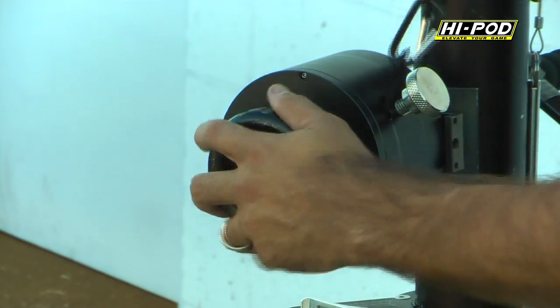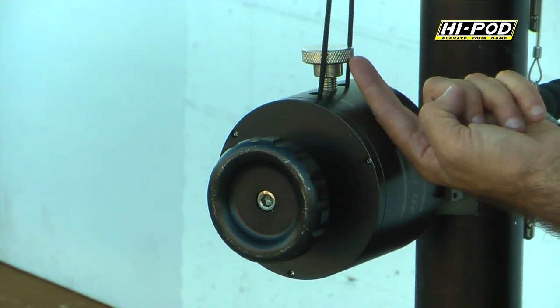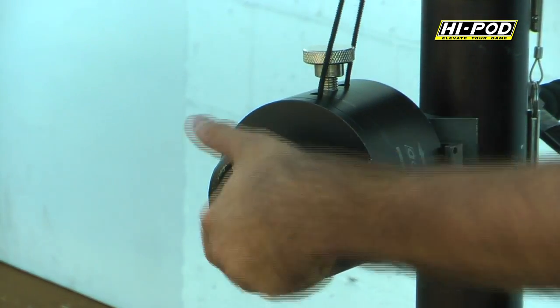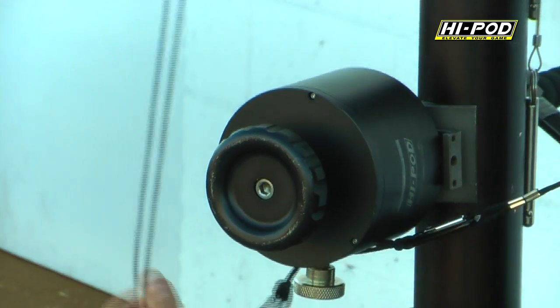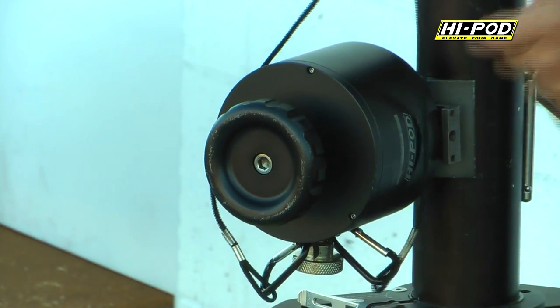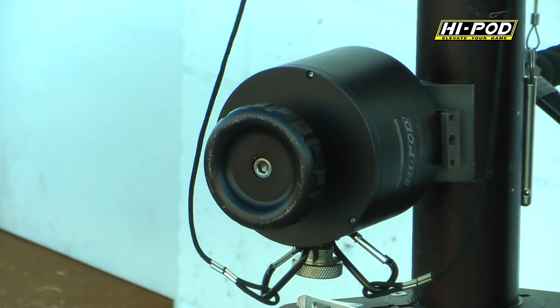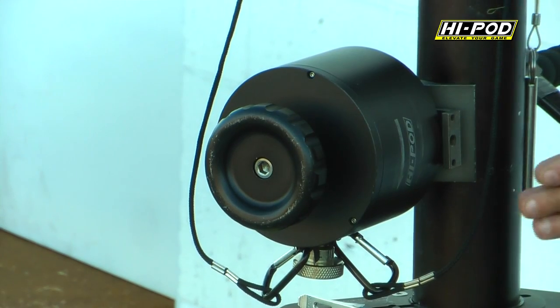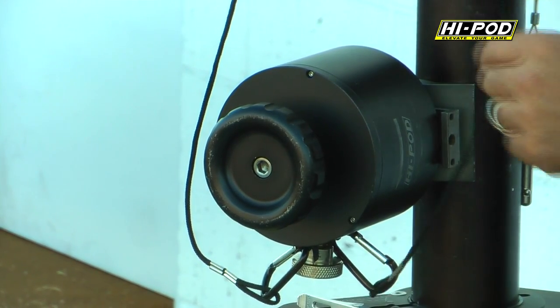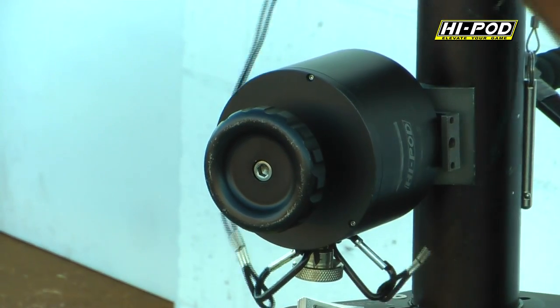If the ropes are like this, where the screw is facing up and the ropes are going straight up to the head, that is bad too. You got to make sure it's facing down, and one rope goes on one side of the cylinder, the other rope goes on the other side of the cylinder. All right, we'll go into more detail, but that is the rule. That is the one thing that makes this use of the handle very simple. All right, ropes on either side of the cylinder, a straight line up to the pulley, no crisscrossing.